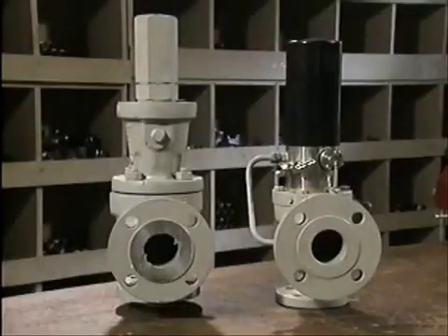In this part, we'll examine the components and operation of two specialized types of relief valves that may either function as safety valves or assist safety valves in protecting pressurized systems. The two types are safety relief valves and pilot-actuated relief valves.